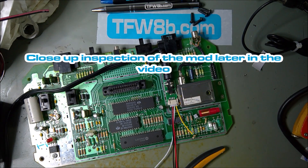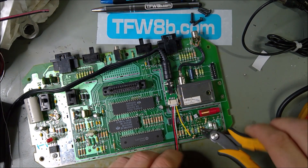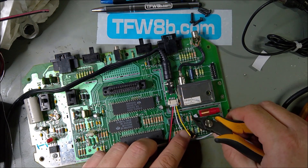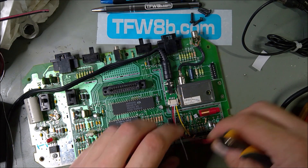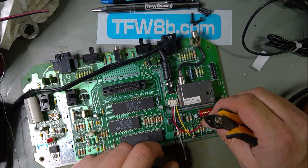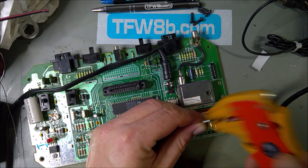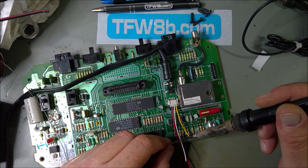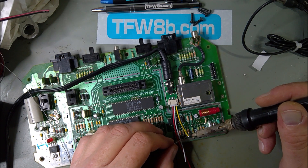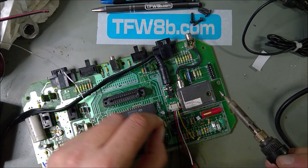Just nip the end off — hopefully my soldering iron's on. It's not. Now, the magic of television — I'll go back to that wire in a minute whilst the soldering iron heats up. The audio pickup goes down there like that, so I'll cut that off. The 5 volts you pick up off the bottom of the transistor here — that's a nice little place to grab it, keeps the wires all tidy.